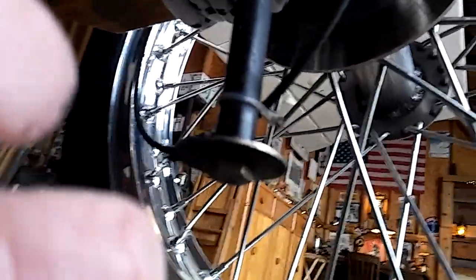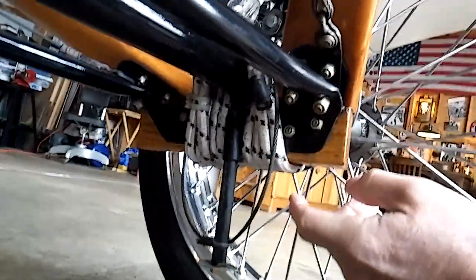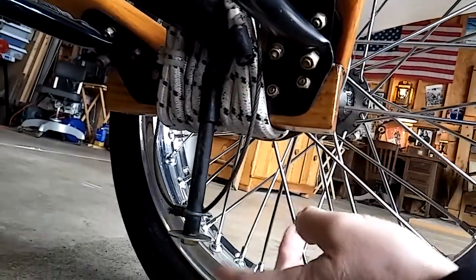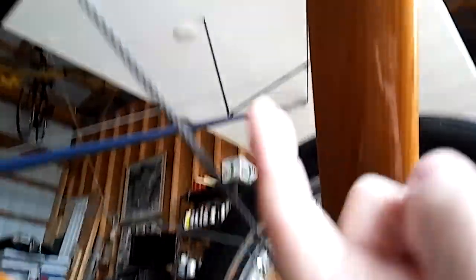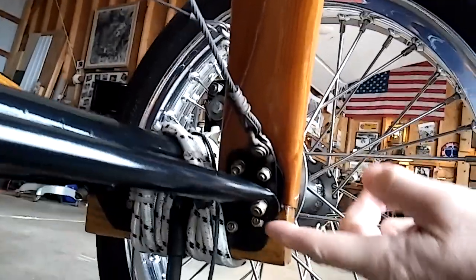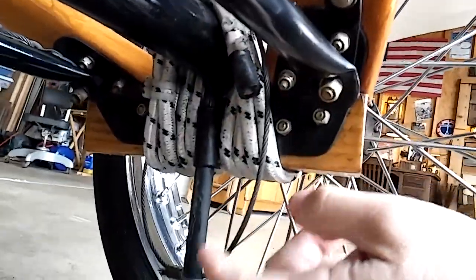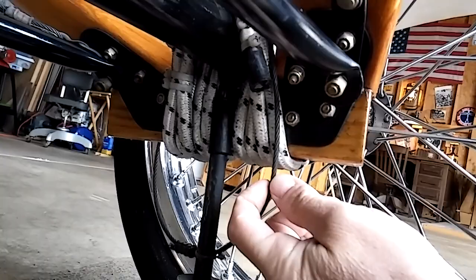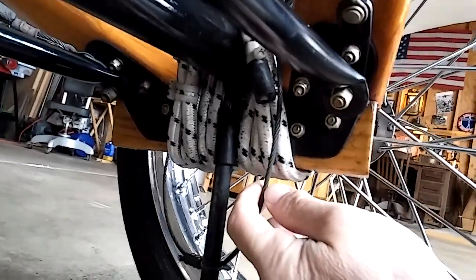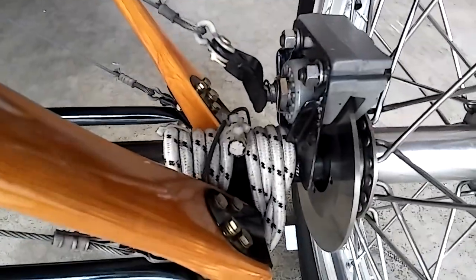With a good thick bead around here, at the bottom I welded in a hex nut. So this is a bolt and washer arrangement, so that when the axle goes up and down, if the bungee would ever break, this washer should theoretically hold the landing gear from going up into the fuselage — because that's where the wheel would go, all the way up into the fuselage, and you don't want that. So I have two safety items here. One is a cable loop — you just Nicropress an eighth-inch cable around the whole assembly so that if your bungee cord breaks, the axle won't go up into the fuselage belly.